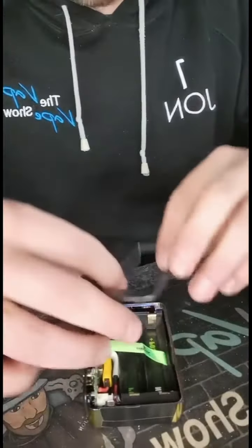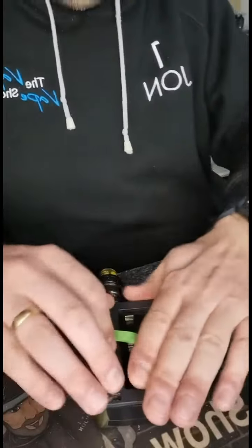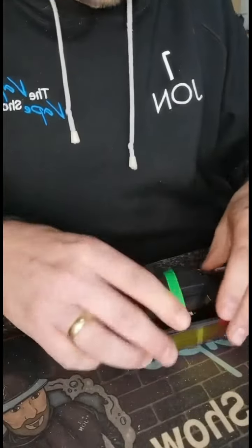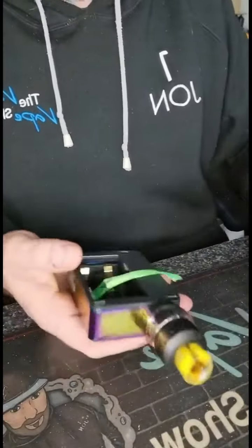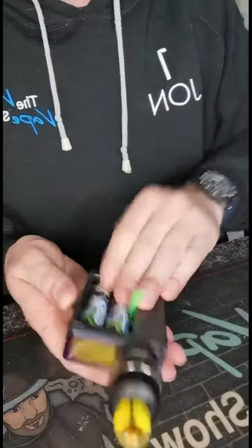You can remove this 18650 battery tray and replace it with a 3S LiPo battery. Using the software on eScribe, that will allow you to upgrade this bad boy to an 11.1 volt, 250 watt capable device. Serious amount of power coming from this mod, and easily done without a huge expense.